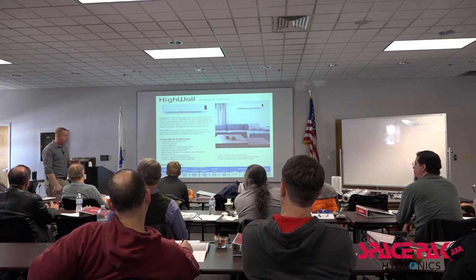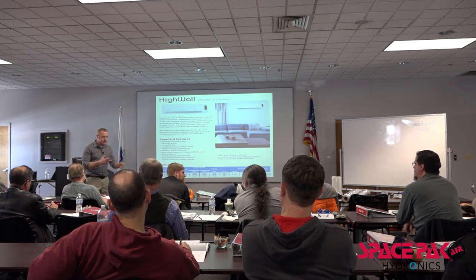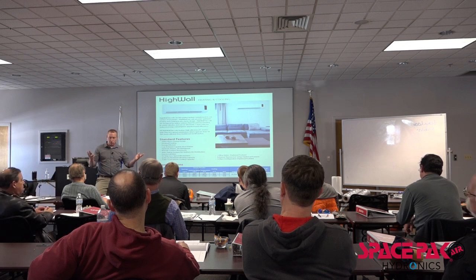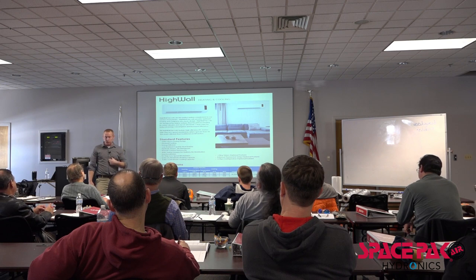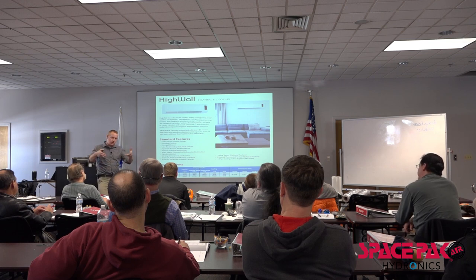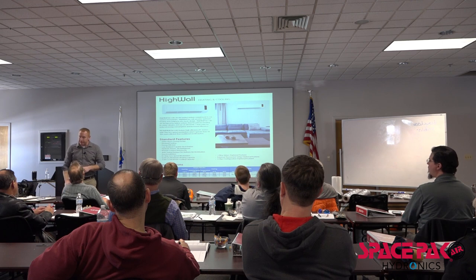So we get a lot of play with, even on a system that's got nothing to do with SpacePak, say you've got a three-season room, and that three-season room, that radiant in the floor is only going to give you 20 to 25 BTUs a square foot. Well, three-season room, you could turn into a four-season room by taking that same water temperature, putting it through one of our fan coils that's meant for lower water temperature, and go ahead and add in another 6,000 to 8,000 BTUs to that room.